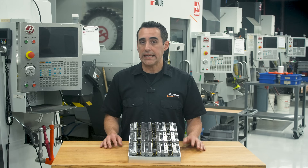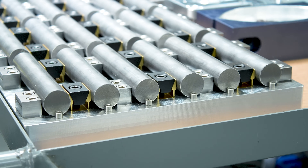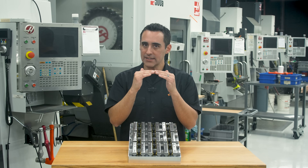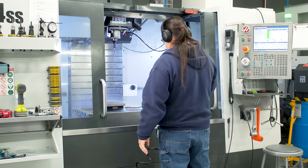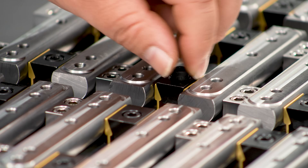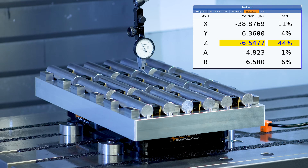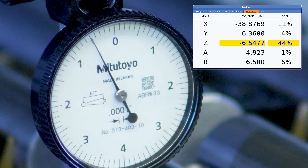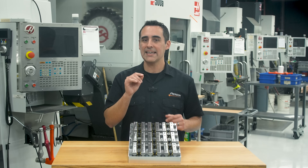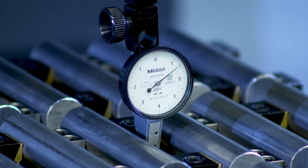The other tip I want to cover is unrealized forces applied to the pallet. When you have this many clamps exerting a cumulative linear clamping force, there's a chance that these forces will add up and actually bend the pallet itself. John ran a quick experiment to demonstrate this: he prepped the pallet by placing all the parts in place and hand-tightening the clamps until they made contact — no high torque, just contact. At that point, we zeroed out an indicator on the center height of the pallet. Since these clamps are torqued outside of the machine, we made sure the pallet was in the unlocked state and then tightened each clamp to the recommended 96 inch-pounds of torque. When we locked the pallet down, we saw that the vertical deflection was under 2 thousandths.